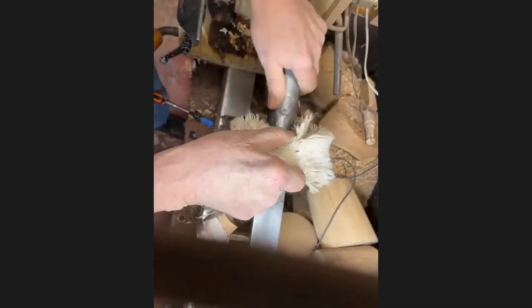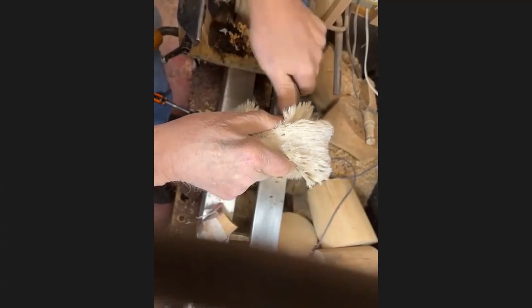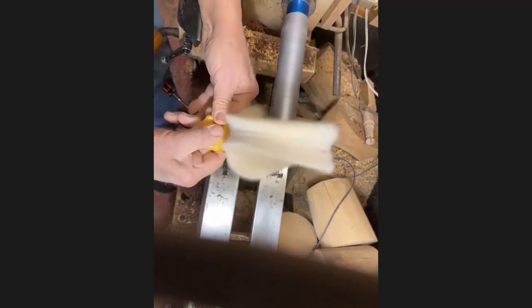And again, on your white diamond wheel or your Vonex wheel, whichever, with one of those two substances, never go above 1700 RPM. And on a wax wheel, I like to be somewhere between 900 and 1000. If you spin your wheel too fast, then the substance that's in the wheel that's holding the pumice will cake up and put little strips on the surface. And then you have to get everything off of your wheel to pick it back up off the surface.